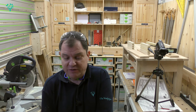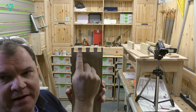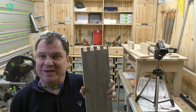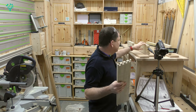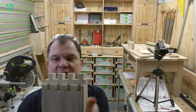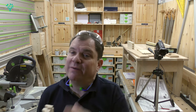I need to point out that I've actually made a mistake here — one we can recover from. Look at that joint: this pin is much wider than this pin. Somewhere when configuring the table, I must have moved one of the gauges. That's given me a consistently inconsistent cut — it's not symmetric. However, it's done exactly the same on all of these, so everything is offset consistently. We now need to allow for that in the next step. It would have been a lot easier if we hadn't made that error, but let's work with it.